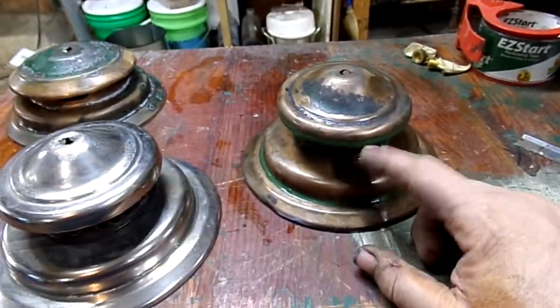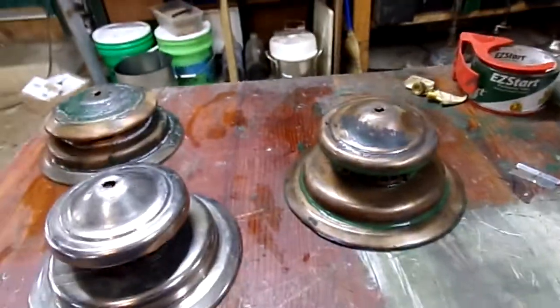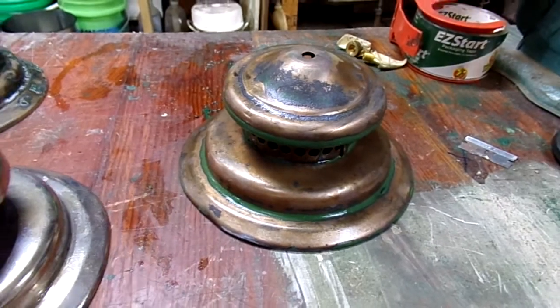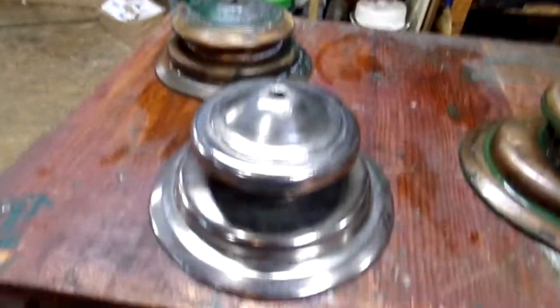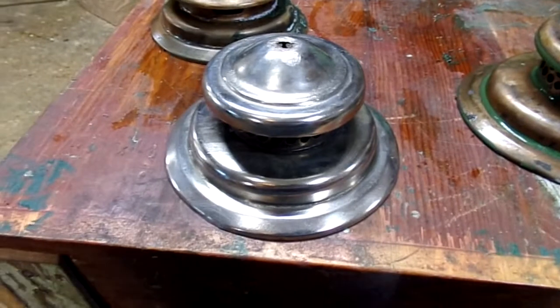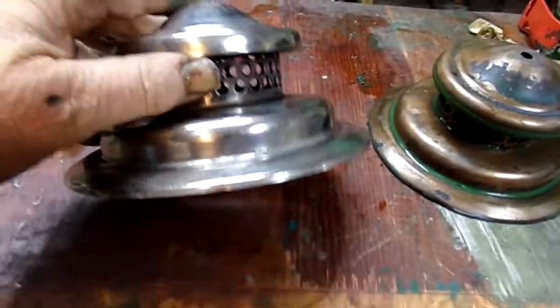This one kind of has a copper color. The reason is my sulfuric acid — I also use it to clean copper and brass, and there are ions floating around which deposit on the steel. But when I wire wheel this it'll come up bright and silver. So anyway, it's not exactly the silver bullet to make life easy and quick — it works, but it's labor intensive.